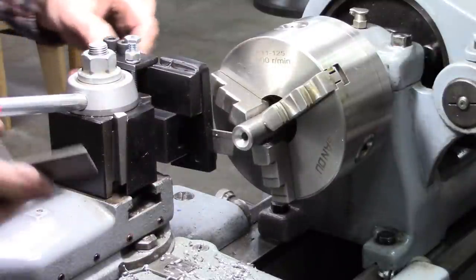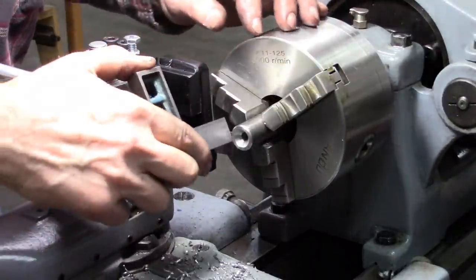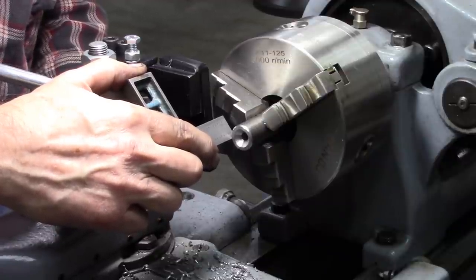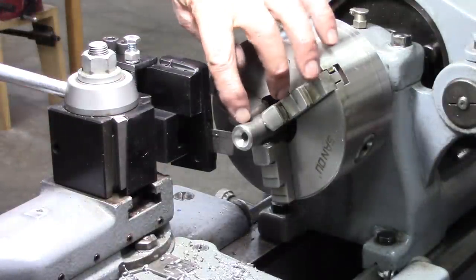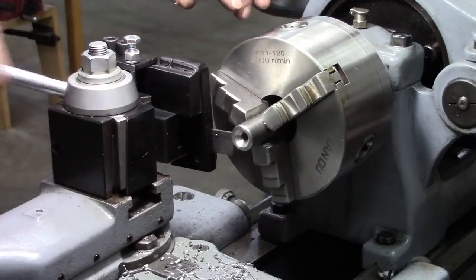Okay, now take the cutoff tool that you just made and use it to cut the washer off. I'm just kidding. You could cut this off with a saw. Cutoff tool is ideal though, if you got another method of cutting it off. It needs to be about 1/8 inch deep, just so that it's the same as that countersink in there.